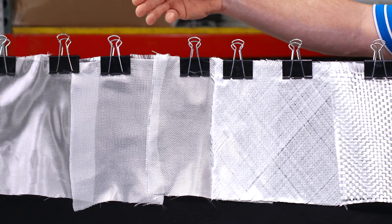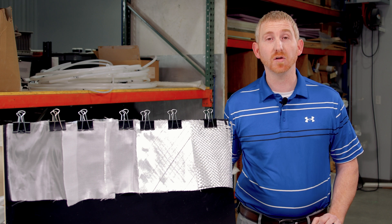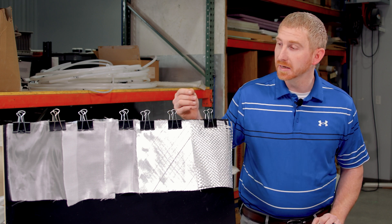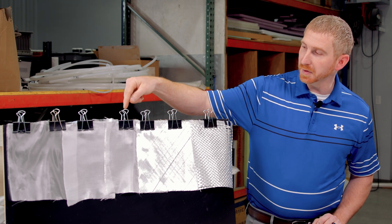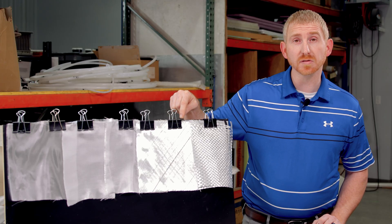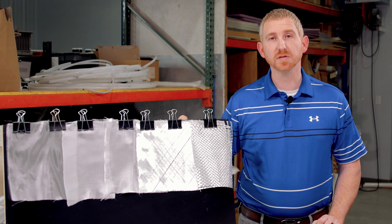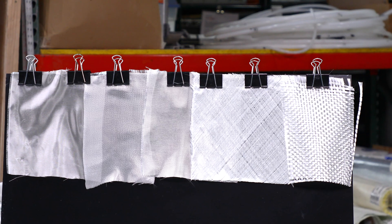The lightweight fabrics are used when you want to really reduce weight — for example, an RC boat or an airplane where you're putting it on the wing. Six ounce glass is used for something like a cedar strip canoe, putting a protective layer on the wood so it doesn't split over time. The heavier weight glass — 17 ounce per square yard biaxial cloth — may be used for repairing the side of a fiberglass boat with multiple layers. West System can be used for pretty much everything, and I want to show you techniques on how to wet them out no matter what the weight.